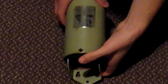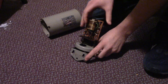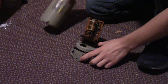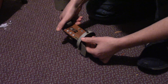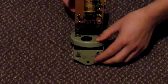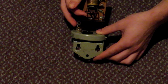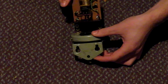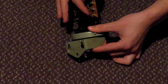So if we open it up here, you'll find your standard relay set. This is a relay, and what happens is when the phone rings — ring voltage, 90 volts AC at 20 hertz — when that 90 volts comes through, this would connect, causing the two contacts to go together and activate the siren via a motor starter. It's a pretty simple system. You've got your relay here that engages when the ring voltage comes in, and then some sort of resistor in there.